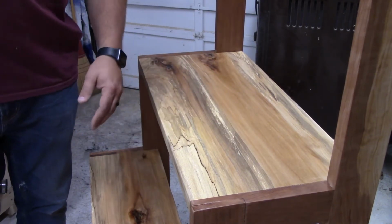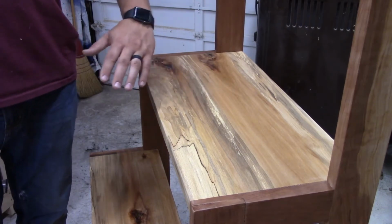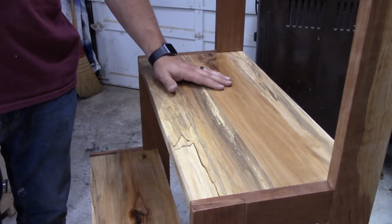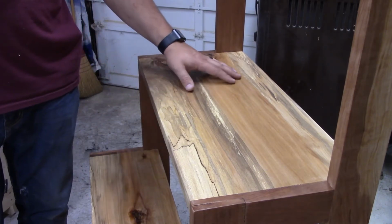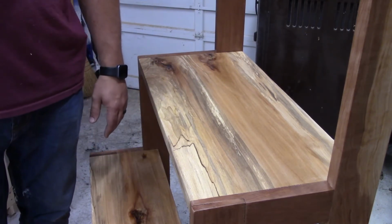It just slides right off. So at your last coat, your 4th coat technically, do the 600 grit wet sand and then wipe it on real nice and thin, and you'll get a glass smooth finish every time.